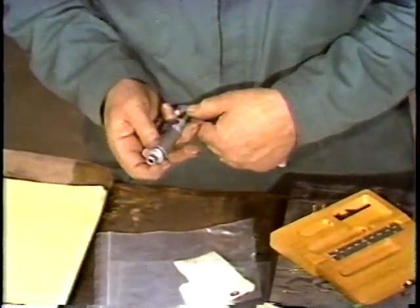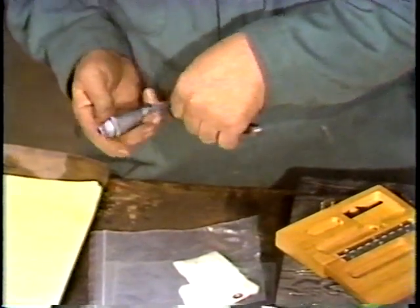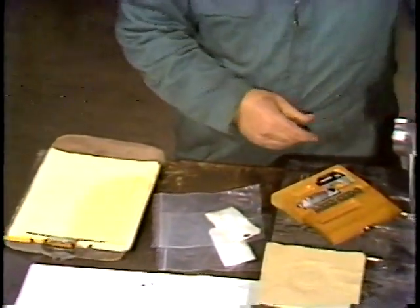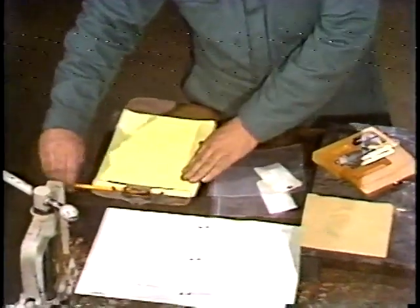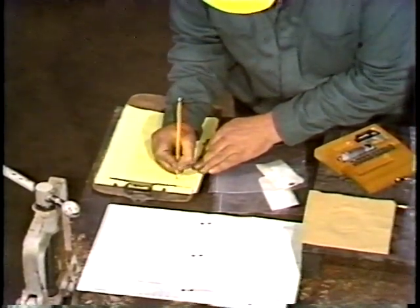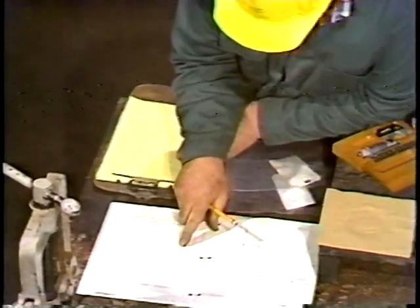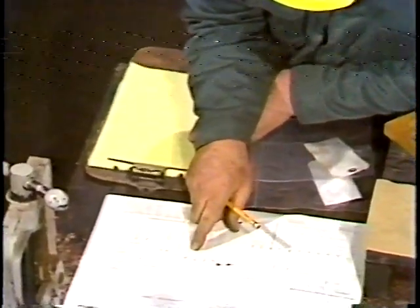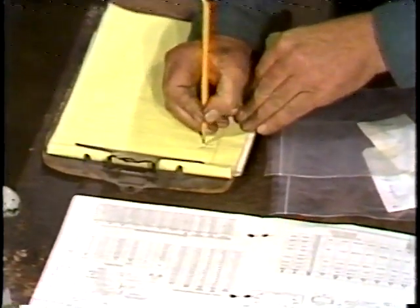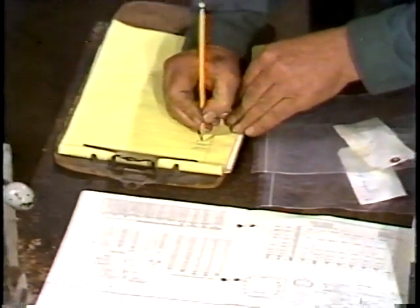Even though the feeler gauge blades have thickness measurements on them, you might have more blades than you realize. So by using a micrometer, you can be sure that your measurement is right. The clearance, which in this case is 92 thousandths, is recorded. Next, the workman checks the manufacturer's instruction manual. In the manual, he finds out that the clearance required for the service this pump will perform is 21 thousandths. This means that right now he's got too much clearance.